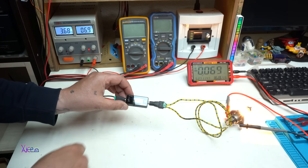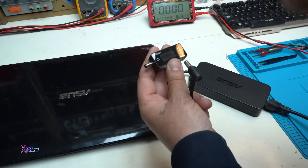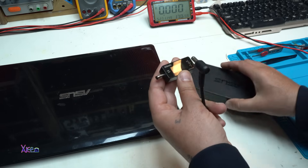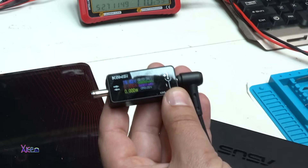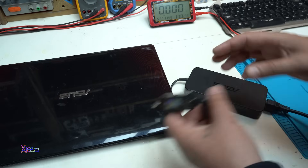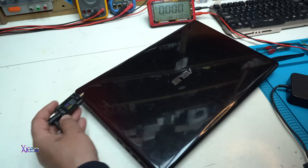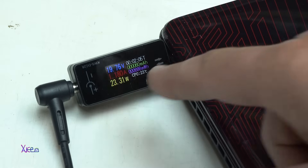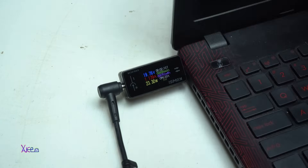All links will be in the description below for this gadget — you can check it out. What is beautiful about this power meter: you can use it for your laptop, using a power adapter that gives 19 volts. Look — we have a readout of 19.8 volts. This gadget can be used as testing equipment to see if the laptop is charging correctly or to find a problem. I'm going to connect it and we can see it's pulling 1.1 amperes charging the laptop, probably because it's full.